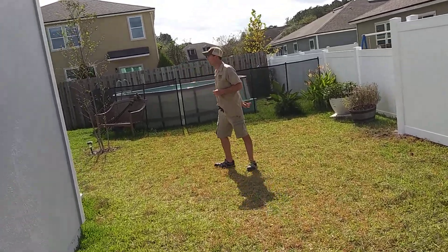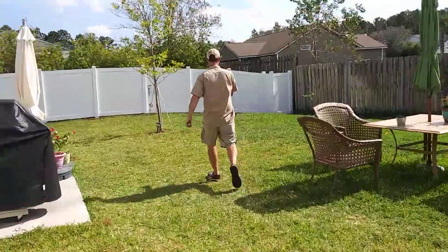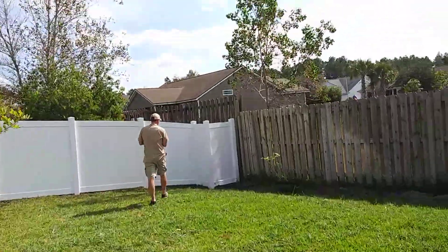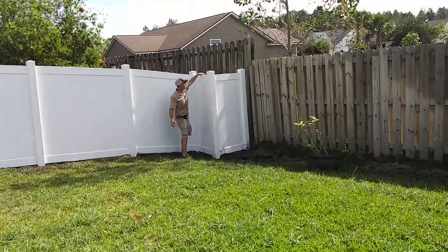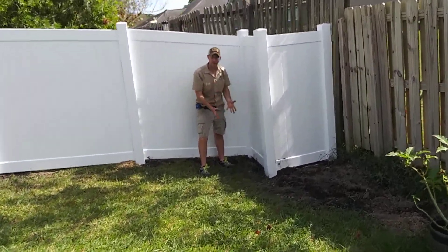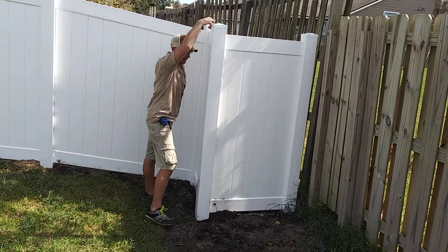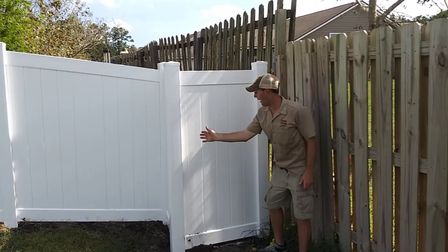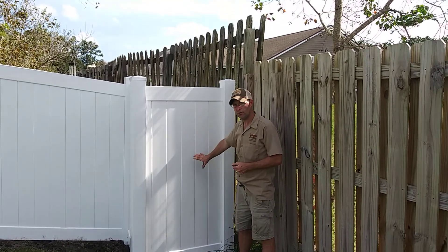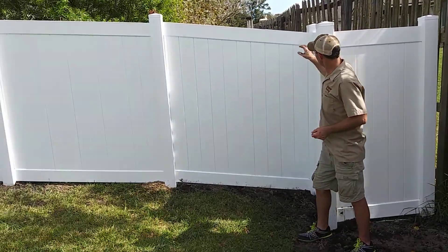I'll describe the transition over here. We've got a drain line over here — the whole drainage range — so it's got metal bars and you can't pack it, can't set any kind of post on it. So what I did was set a corner post here, corner post here, end post here, and boxed it out. That way they were able to keep as much property as possible and still have full use of the drainage system right here, coming through on the corner plot.